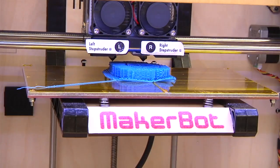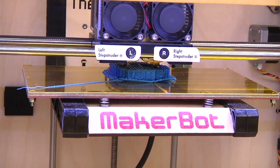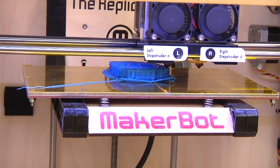It's also a little bit more toxic. It produces fumes. The material sheet on it says that it's perfectly safe to breathe the fumes. I find that when I do a lot of ABS printing, I get a little bit of a headache at the end of the day, which probably means it's not real good for you. So to recap, the major components of a modern 3D printer are the print head with the stepper motor, and then the carriage. That's the thing that holds the print head and moves it in different axes.